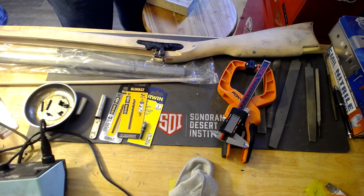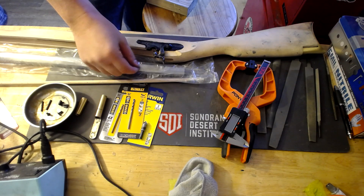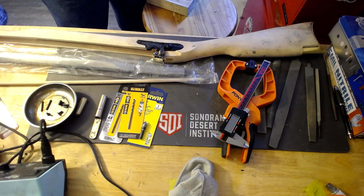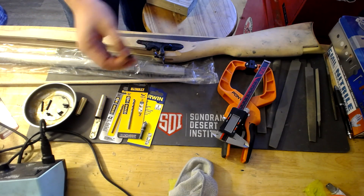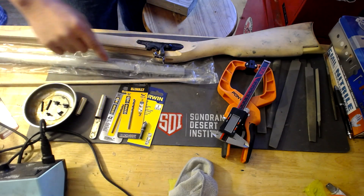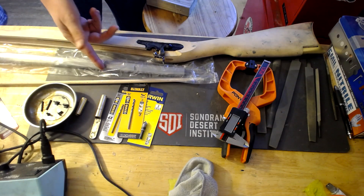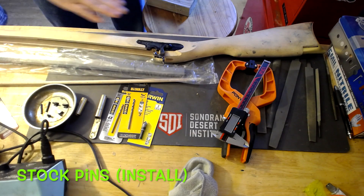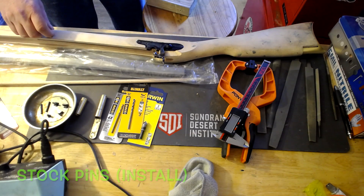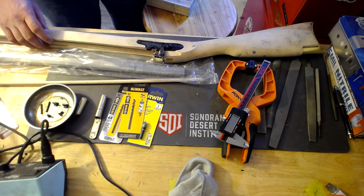On the barrel here there are machined grooves — basically a dovetail deal. These are roughed out, so I've got to polish these up and get them to fit in here because right now they're not going to fit in real well. Then I'm going to put the pins in so that we can get the barrel and the stock married together.